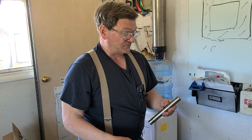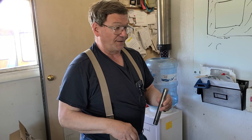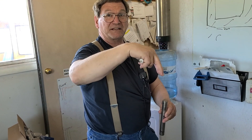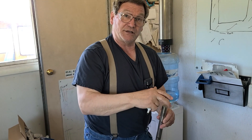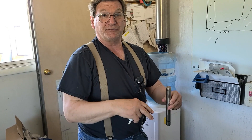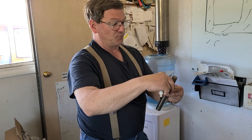These are used by utilities, power plants, sewage treatment plants, big mines — really pretty common pumps. The motor is vertical and runs at the top. The motor will also have a backstop — a ratcheting backstop — so it can only turn one way. That prevents accidentally turning it the wrong way, and also prevents the load on the water from rotating the motor after it stops. You always want to keep the rotation the correct way.